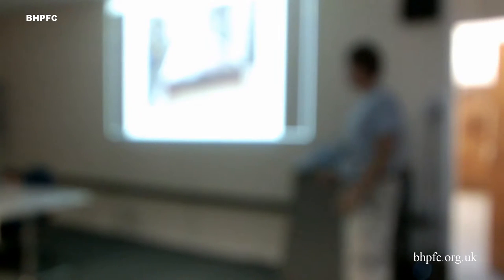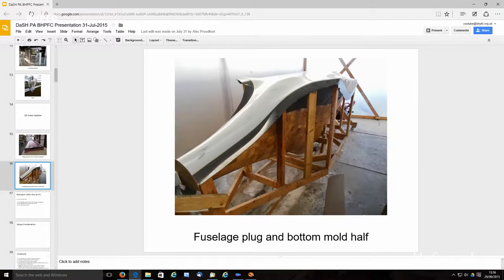So I've gone down and advised them a few times. The new team is now rethinking things, and they may go back to more of an underslung fuselage frame instead of this sailplane-like fuselage that they worked on before. They had a sailplane-like fuselage, the idea being that it's going to be really sleek and low drag, but they never totally worked out what they were going to do about the fact that the prop was going to be hitting the ground if they got low.